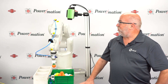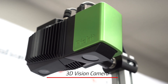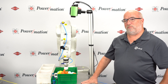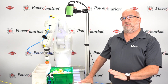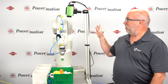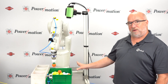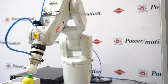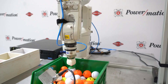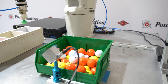This system is using a vision system from Pickit 3D. In this case we have an ABB robot running, however the camera system works with all of the major vendors of robotics. The camera gets calibrated and will then look at the objects in the bin — in this case simple round objects, or golf balls — and then communicates that position back to the robot to tell it what to pick.